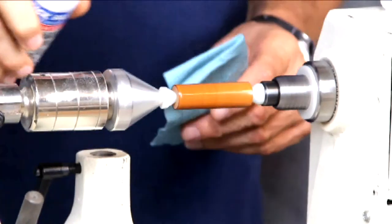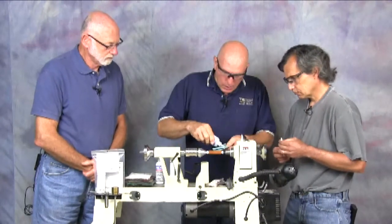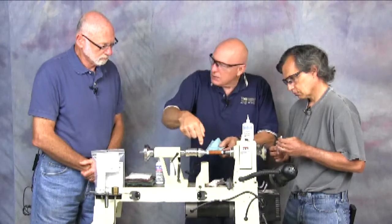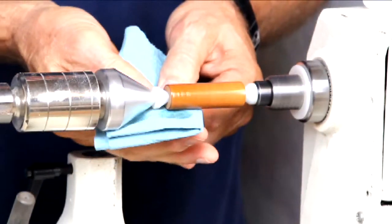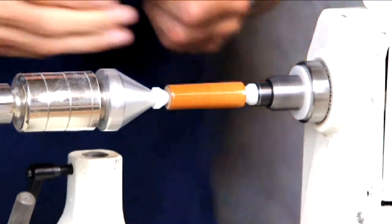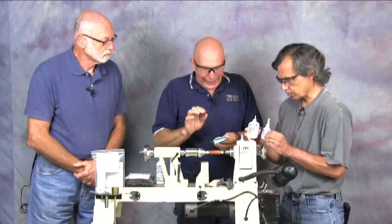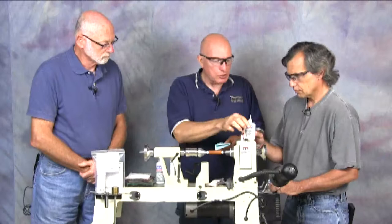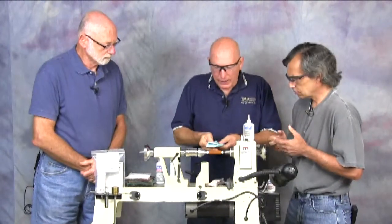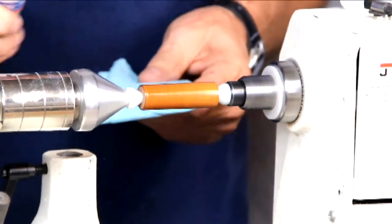Again, a thin coat. Another thing is that you don't sand between coats — don't try to put the finish directly on the piece; just put it on the towel and then a nice, quick, easy pass across. The first smaller bottle is the thin CA; that's why it's a smaller bottle, because you won't use nearly as much of it. Then this larger one is the medium. The thin allows it to really penetrate into the wood, so I'm trying not to put very much on in each coat.